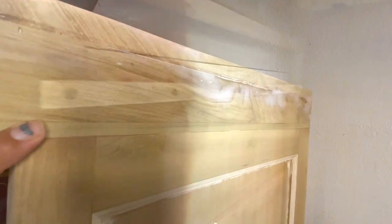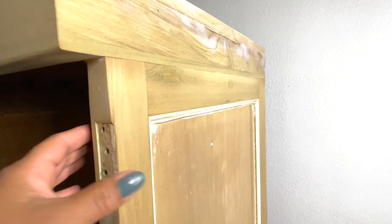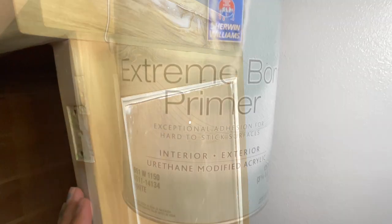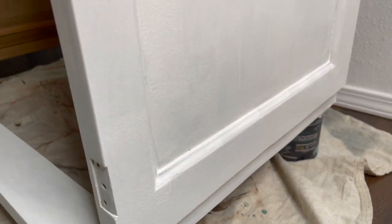The main body was now prepped, cleaned, and repaired, ready for paint. Before you start judging me — look at the wood on this piece. It's mostly made out of poplar, and the manufacturer had originally painted it as well, so I'm going to do the exact same thing. I needed to put a base coat of primer first. This Extreme Bonding Primer by Sherwin-Williams is quickly becoming my favorite.